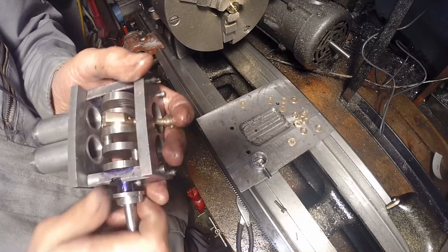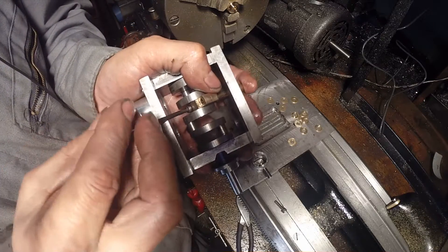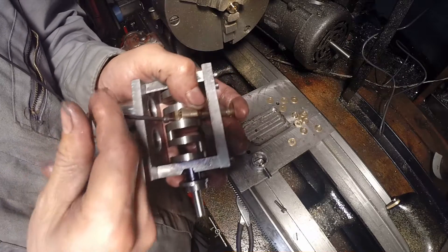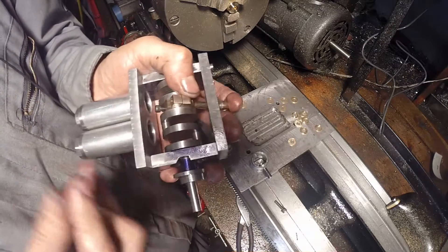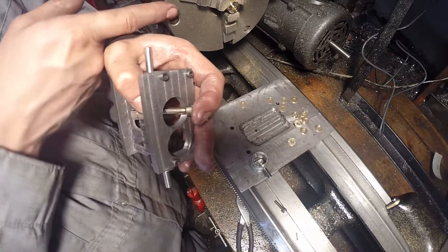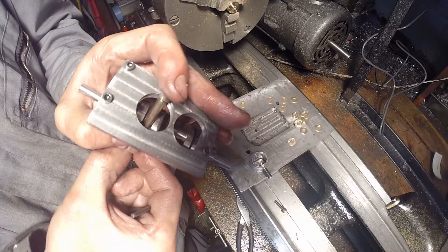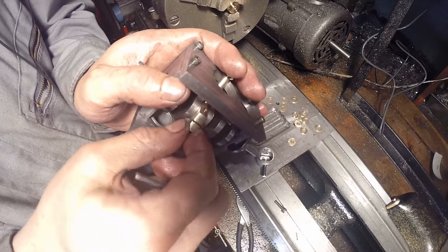I'm going to try and make it easier this time and take out the connecting rod. I did measure these holes in relation to the crankshaft, so it may be the case that they are pretty centered — I measured from a reference side and then added and went over. Except I basically center punched in the metal and then mounted this piece onto the face plate so that I could turn the threads. I'm starting to wonder if using threads to connect the cylinder walls onto the main engine body is a good idea or not. One thing is they could loosen up, but that could be fixed with Loctite.